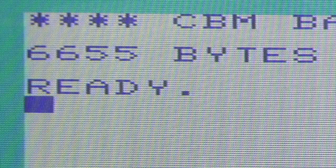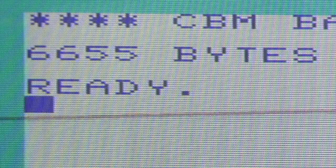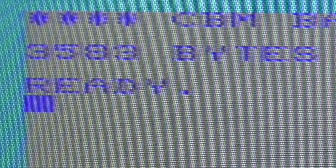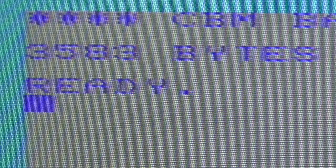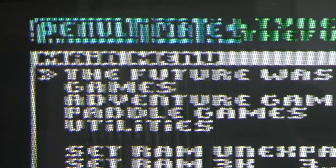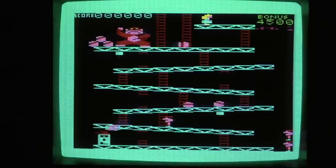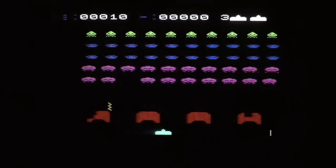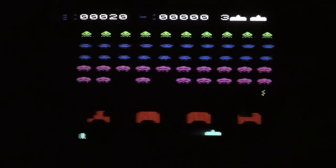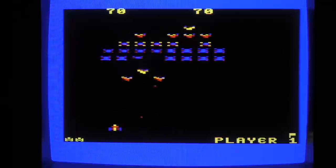So the first thing I wanted to do was keep the camera pointing at the screen and swap the cable over to an original VIC-20 with composite, and take a look at the difference. Here's another example — this is the original VIC-20, and here is the kit version with S-Video. I've honestly never seen video like this from a VIC-20. I can't even really get the camera to capture how good it looks. It's not just the sharpness, but there's also no dot crawl, which the VIC-20 is notoriously bad about. This actually looks fake, like it's coming from an emulator or something.